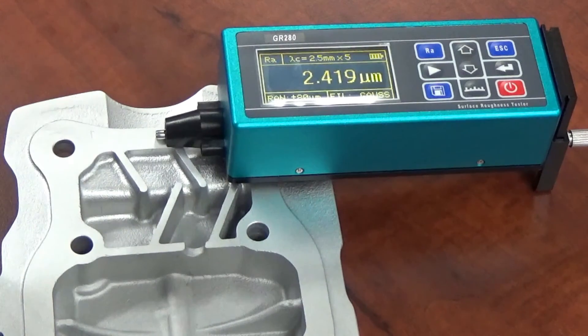We're actually going to be preserving, not destroying — and that's the main point here. The numbers are drastic; there's a major difference. That's a sealing surface on a cylinder head, and you know how important it is to have a beautiful smooth surface for sealing. Not only are the aesthetical characteristics different as well — something we've covered in our previous videos — it's just a massive improvement on the surface integrity, the finish, and the roughness.